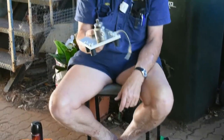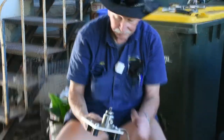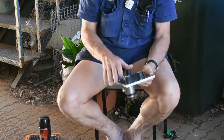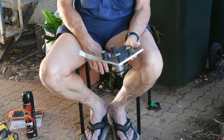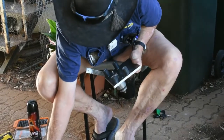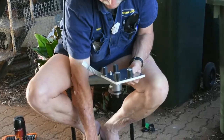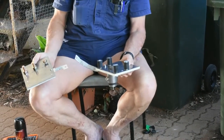There's a hole in the middle for the antenna mount — and that's the antenna mount for this particular antenna. As you can see, it's a very heavy, robust mount. The last thing I'll show you is these bonding straps. It's all fairly simple — it's just merely assembling this. I'll show you the finished product in a minute. The only important thing to show you here is I've used spacer washers to get them nice and level, to shim them up between each one of these four rubber posts and the top bracket.